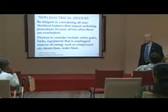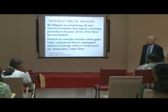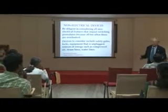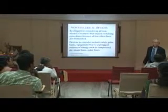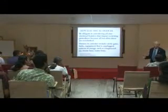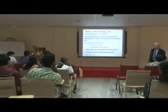One thing, think about springs. Some of these breakers and equipment have heavy-duty springs, and if you trip the breaker and then the spring operates, that's a tremendous mechanical force. You can smash your fingers or do other things. So think it through carefully, and if it's at all possible, get somebody to follow after you to make sure that you got everything.